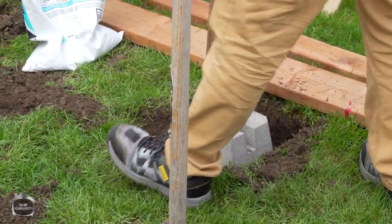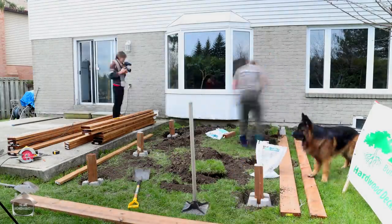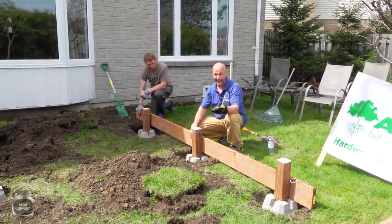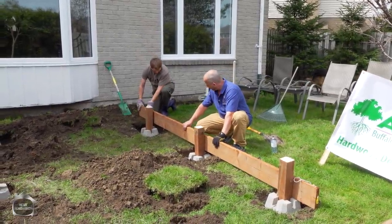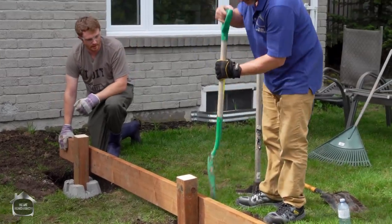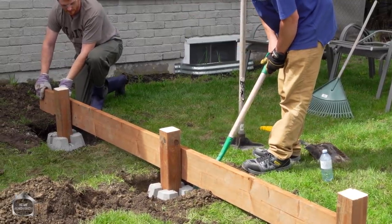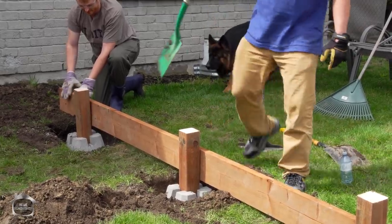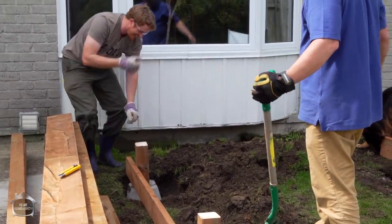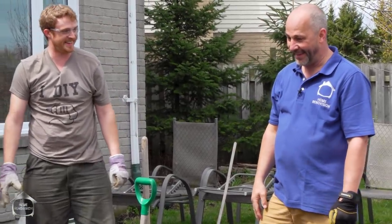Taking a 12-foot piece of lumber and lining it up to make sure all of our posts are in contact with each other. That one's a little bit out - I'll show you the secret. Just push that block without disturbing the soil, then push the board over nice and flush. Now we'll do the other one. That'll carry the load - we are halfway done our deck.